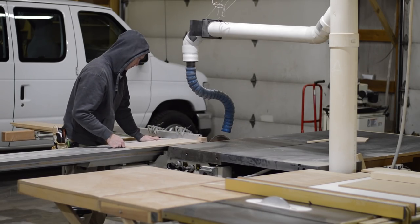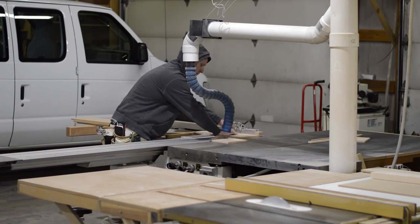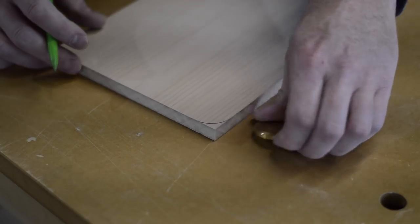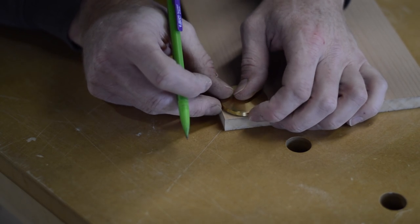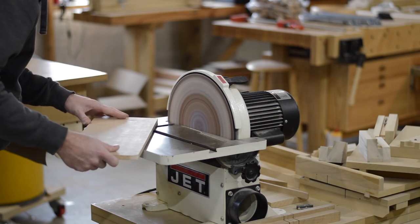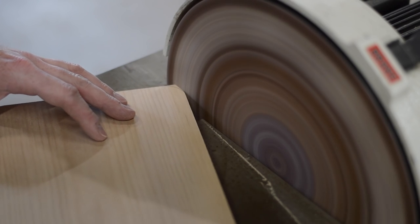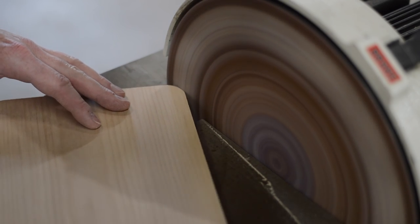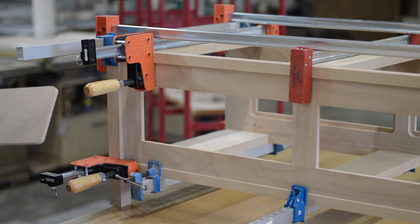Now it's time to cut out some veneer-coated MDF, which will fit in the openings of the sides of the coffee table. Since I used a router to cut the rabbet, the inside corners are rounded, so I either need to square the rabbet or round over the corners on these panels. I've left these panels out until now for finishing — it's much easier to stain and topcoat a separate panel than to get into all the nooks and crannies once it's installed.